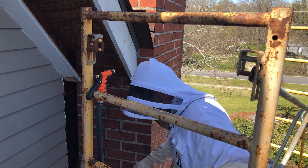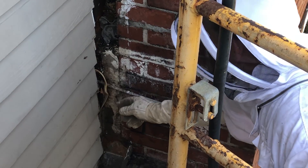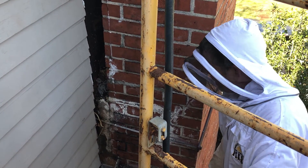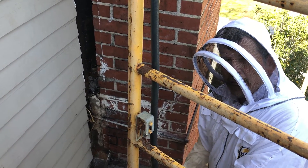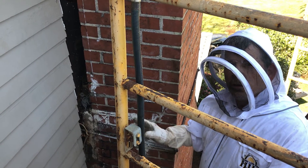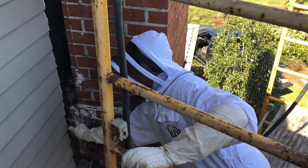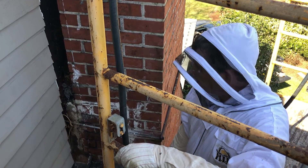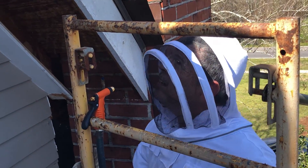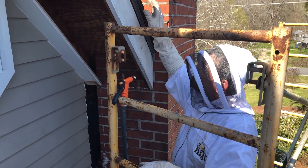On a previous video I think we mentioned this wire. This is some Romex that originates inside the building, then comes outside the sheathing, and then goes back in the building — so that had to be a renovation, something added later. The other side of this wall is a beautiful textured hand-painted finish that the homeowner did and we don't want to get in there because we'd never be able to fix it. Fixing it would be another huge project, so we're just going to do the best we can with that wire — we may have to put a bevel on the back of the two-by-six to accommodate it. Let's pull the rest of these nails, clean up the caulk, go downstairs and start cutting. We'll give it a coat of primer and paint it the same as the other soffit and seal all the edges.